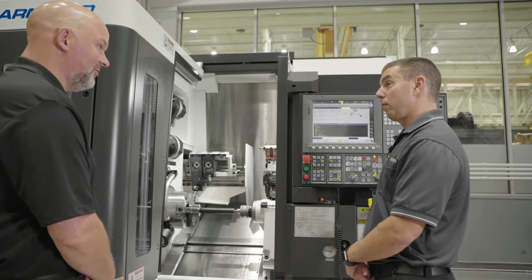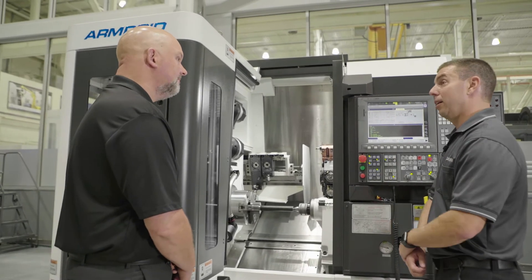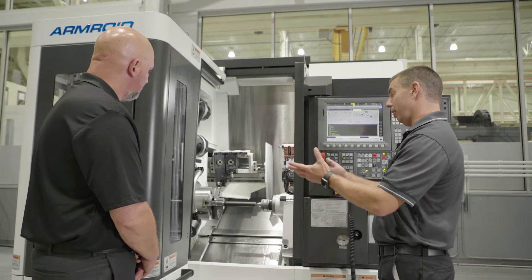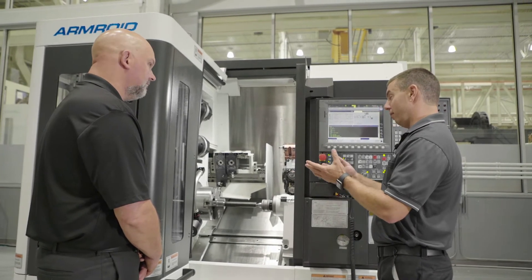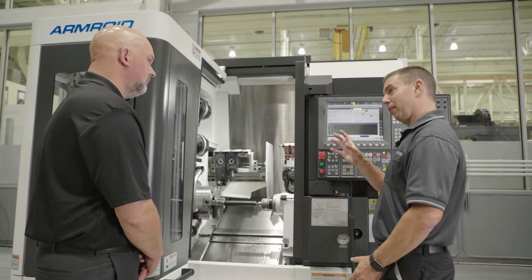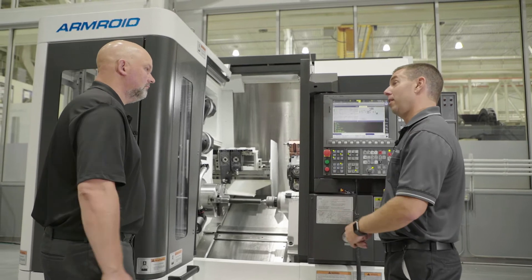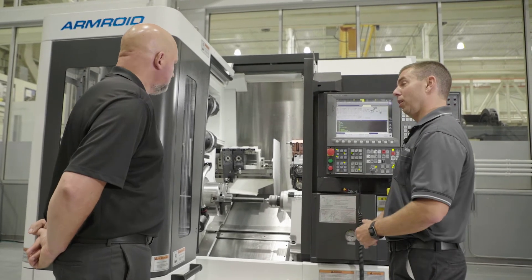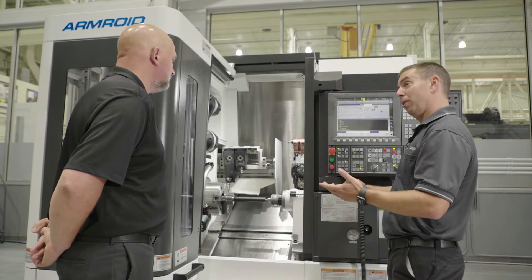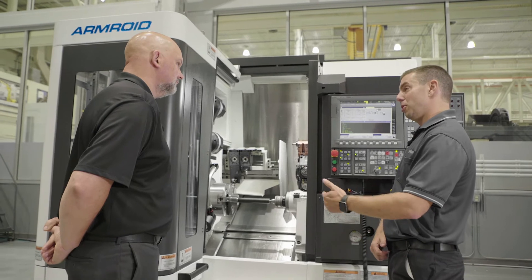So it's really a lot more than just a robot loading and unloading. Absolutely — if you only want the gripper you can certainly do that, but you also have the option for other accessories. This particular Armroid is for shaft work only. We also have another type of Armroid for chucker work, where the gripper is more of a three-jaw chuck style for parts that go in the chuck rather than shafts, with a lift-up style conveyor rather than four shelves — similar to our OGL series. A few different options to suit just about anything you need.